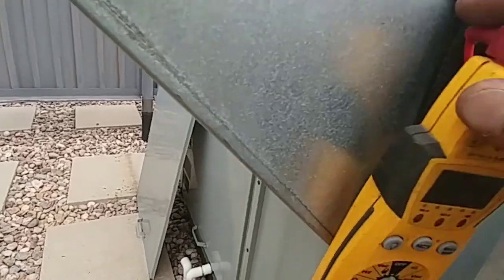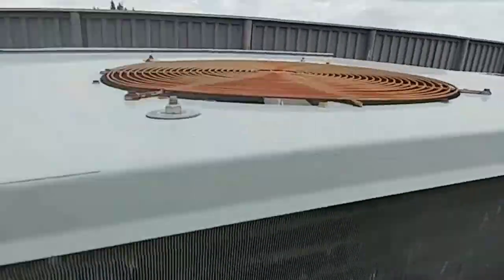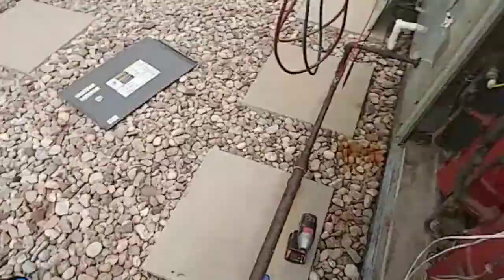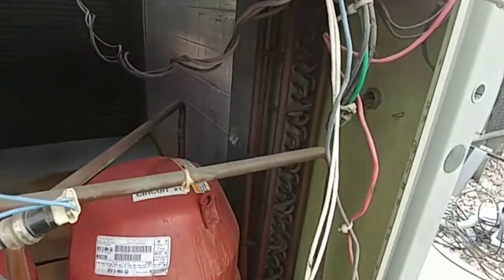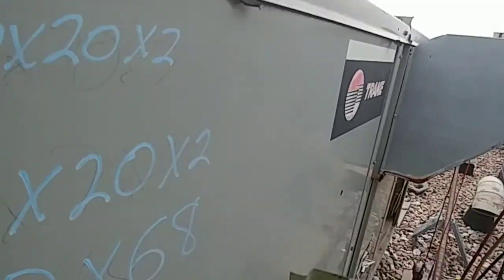Normally what I'll do is just grab a screwdriver, come over to the fan motor, and try to spin it. So it spins freely. We've got to see if it's the fan motor that's bad, or if it's the contactor or the control. I think this one has a relay for the condenser fan motors — could be wrong, so we'll find out.